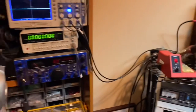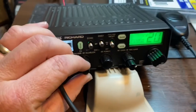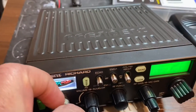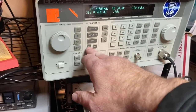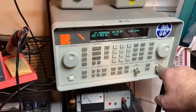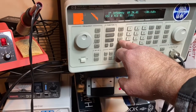Check out the receiver on this thing now — it said minus 128. You can hear the tone in. You can hear it down here, down to about 130. That's at 30%. If I bump that up to 50%, check them out on 30%. And you can hear it down here and it hit 118 — perfectly fine.